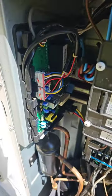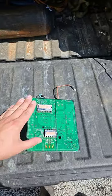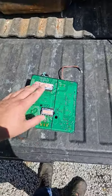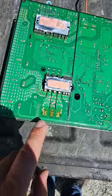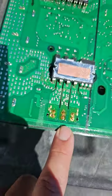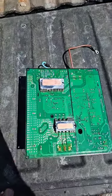How do you do that? Let me show you. Error code E458 means outdoor fan error. Verify the voltage from the inverter board to the fans, and also unplug the disconnect, turn the breaker off, and take the inverter board out. Flip it over and see if you've got any burnt spots. That could be an indication the inverter board is the problem and it's bad.